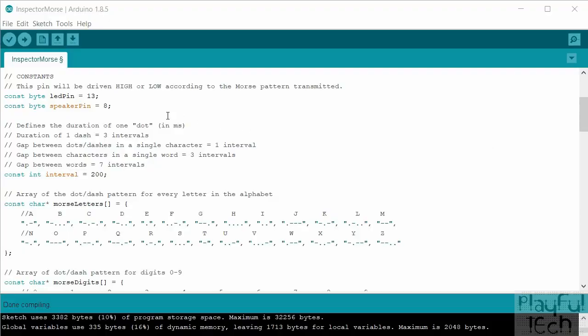Here's the code running on the Arduino. I start with constants at the top: the speaker pin is pin 8, which generates the audio tone signal sent to the FM transmitter. I've also defined an LED pin — when the Arduino sends a Morse code signal, it also flashes an LED in time with the message. This is useful for verifying the Arduino is functioning correctly and transmitting the correct pattern without needing to have the radio tuned. Both the tone and the LED encode the same Morse code message in synchronization.